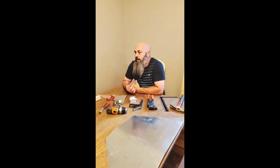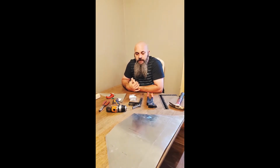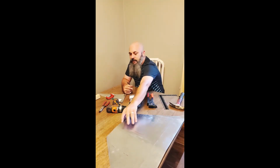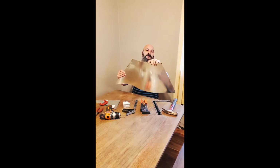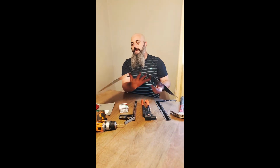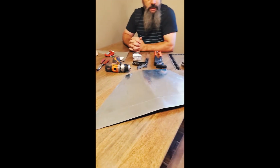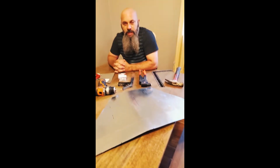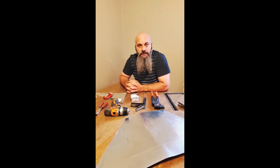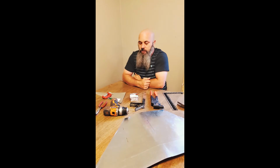Now, before we start, and I'll show a picture of this, the overall dimensions: it's a trapezoidal shape, with 14 inches on top and 30 inches on the bottom, the wider side. And then, of course, it's 14 inches wide. But I do a couple things different. One, I bend the top and bottom of the cone over a quarter of an inch. And we'll also bend the sides a half inch in opposing directions, and I'll show you what I do that for when we get to it.